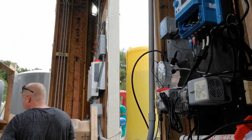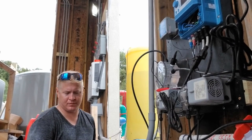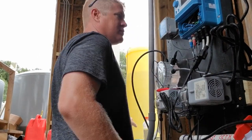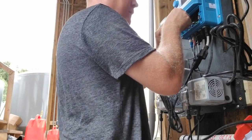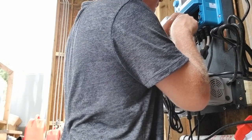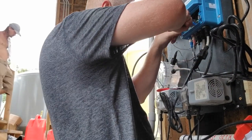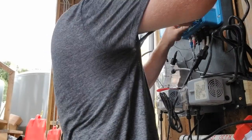It's really important to be able to see clearly, so if you need a cinder block, you can always find one. Once you have the wire installed into the controller, you want to cut it to size and strip back about one-third to two-thirds of an inch of wire, so that you can slide it into the slots on the connector for the terminals.